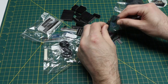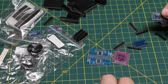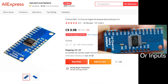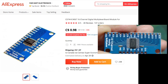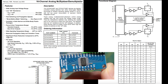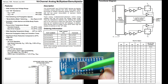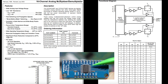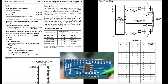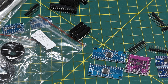Now there's a bunch of modules here — probably just as well to dump these all out and see what I have. A 16-channel analog multiplexer. I can see 16 output channels, power, ground, enable, four address select pins, and a signal pin. It is a 4067. This chip has 16 single-pole single-throw switches in it, and only one is turned on at a time, chosen by the 4-bit selection address. That signal pin will connect to just one of the other pins at a time, and you can use analog or digital signals. So you can select from 16 sources routing down to one output, or take one input and route it to 16 outputs. I just thought that would be interesting to have on hand — you never know if you'll find a use for something like that.